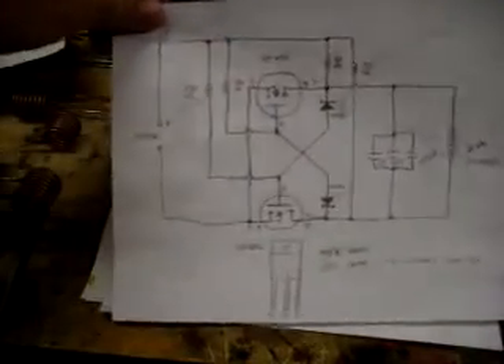Let's look at the circuits again. There are a lot of different ways to build this circuit. This is one of the ways I tried building it first right off the internet, and it gave me all kinds of trouble — I kept blowing capacitors and MOSFETs. This is my next circuit that I built, but I only used two of the .47 microfarad capacitors and my frequency was 21 kHz, which was way too low. It took two minutes to heat a little tiny nail up. I put a 7812 voltage regulator in the circuit to get 12 volts, and that worked pretty good, but my power supply was still putting out ripple DC and that was giving me a lot of trouble.